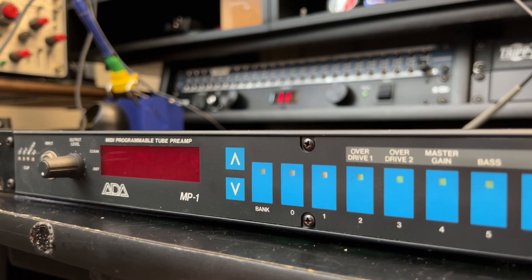For those of you out there that have these units: when you're powering on and booting up, and you see it scrolling through all of the presets or banks 1 through 128, then you get the error codes and it flashes and goes back to 1 — that means the battery is no longer sufficiently charged. It can no longer lock those presets in.